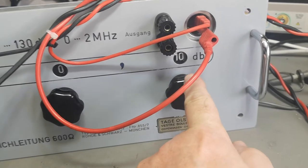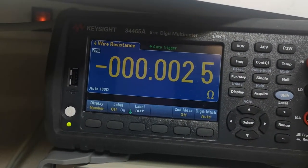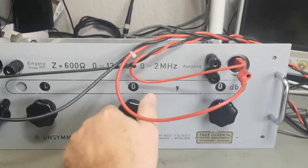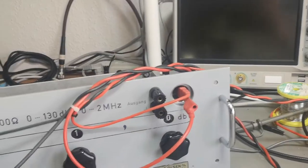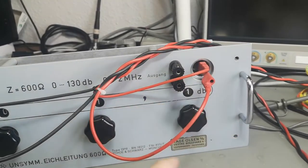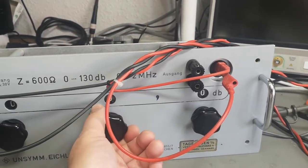Can you imagine how old this is? How did they do this? Here's a funny thing — this is 1 dB, so the number here is 68.37. Let's dial back to zero — we still got zero, only two milliohms away. Now let's take 1 dB on this one — 69. It's far from the right value but it's actually quite amazing. In this range they're using all the resistors connected in series through all those steps, and all they need to do is match. I'm a little bit amazed and impressed.